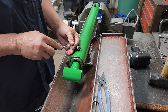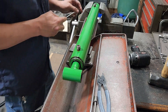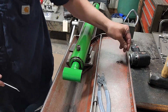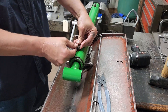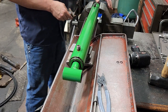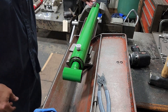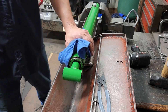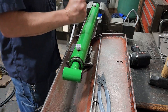We'll go ahead and change these o-rings real quick — these are number six face seal o-rings, or flat face. Put the new o-ring in the groove, new o-ring in the groove. Put the caps on, wipe it down and that's it. That's how you reseal a John Deere — I believe this was off of a 400X front end loader.